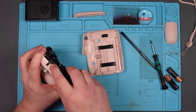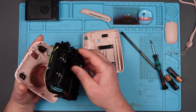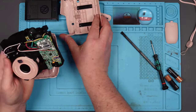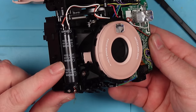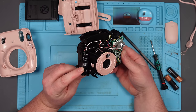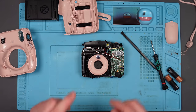There was a sneaky little screw hiding behind that - I'm lucky I spotted that. Wow. I have no idea what I'm doing here. Look at that capacitor - that must be for the flash. 320 volts. Okay, I need to be careful because I've just had batteries in this. Let's just see if there's any charge in that capacitor.